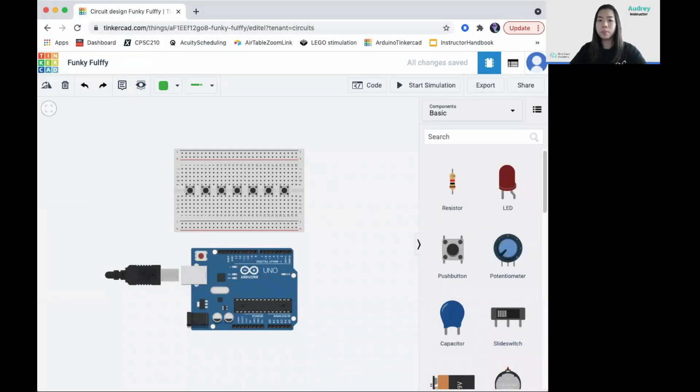In each of the left upper legs of these push buttons, place one of the resistors and connect them with the upper negative rail. Start with the 1K ohm resistor on the left-most button, then place the other six 10K ohm resistors on the remaining buttons.